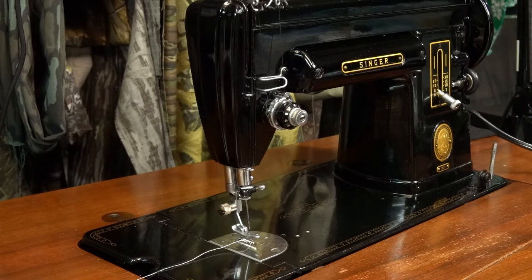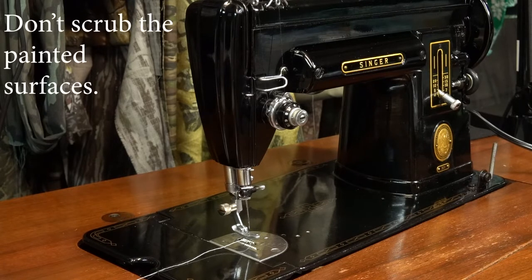I have gone over the whole thing and cleaned it as best as I'm willing to do. Usually when I clean machines, what I'll do is I'll take a nylon scrub brush that you would find in like a gunsmithing kit. And I'll use kerosene to soak all of the moving parts or areas that have lots of varnished oil, and I'll just scrub them vigorously with the brush, and that does a pretty good job of cleaning up all of the pivot points and all of the shafts and gears.